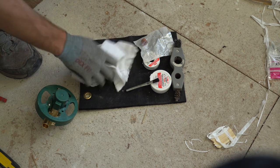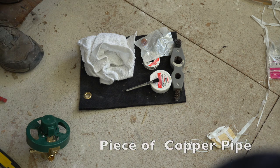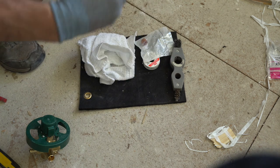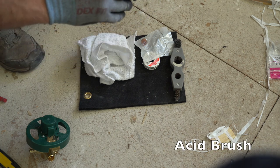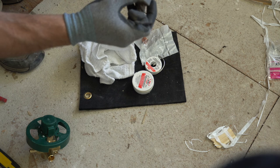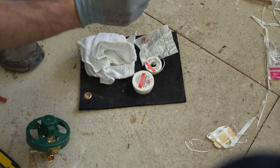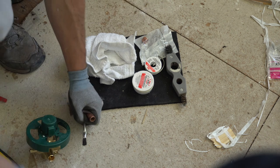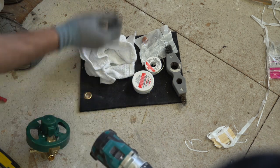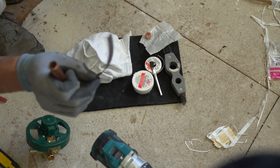Some of the things we're going to need: you need a clean towel, your valve obviously, a piece of copper — you can use any old recycled copper as long as it's the right diameter — some water soluble flux paste, an acid brush, some silver solder, and a wire brush to clean out the copper. I use the outer ones and then use my drill with one of these attached; it just makes it a little easier. I'm also going to use a copper cap and some wire mesh.